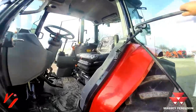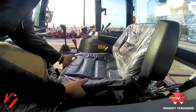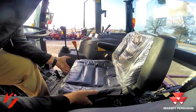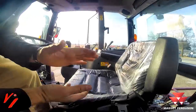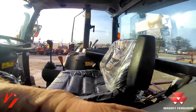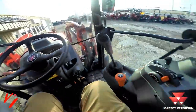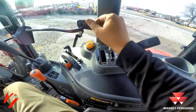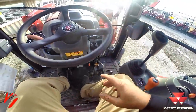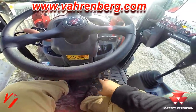Now we're going to jump into the 4610. You have a two-door cab with cab doors on both sides. One of the coolest features is the accordion seat — you can start it out low, come up one notch, another notch, or go back. You've got different starting heights with the same spring suspension. You have your two remote valves here with float positions, and this is your PTO engagement — it comes with soft start PTO. That's your emergency brake and your brakes.